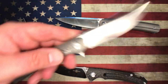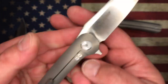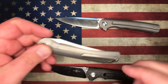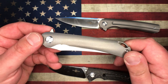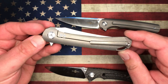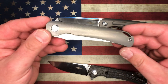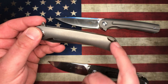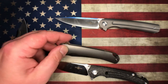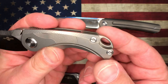The TS-159 is S90V, full titanium frame lock. All four of these knives are riding on ceramic bearings and have ceramic detent balls, and all of them have hardened steel inserts on the lock bars — even this liner lock. You can see there's a lanyard space integrated into the backspacer, nicely done, very similar to the 182 and the 199.